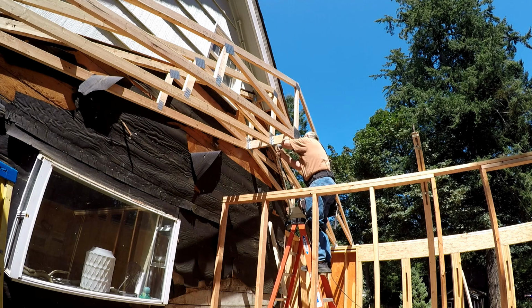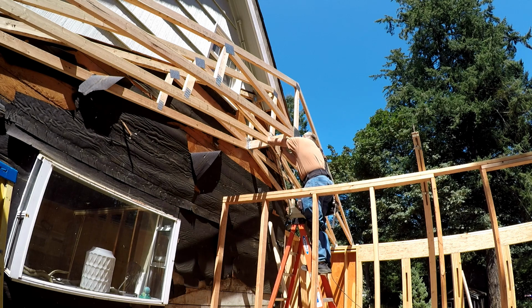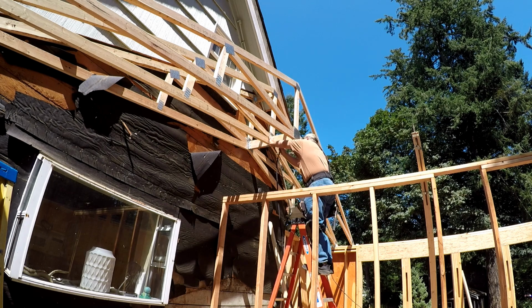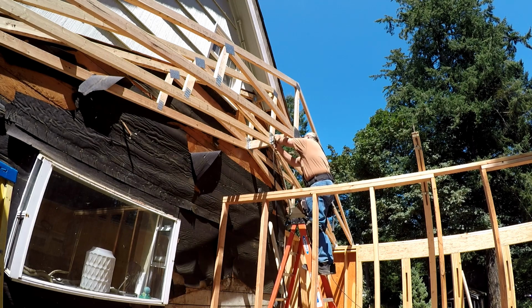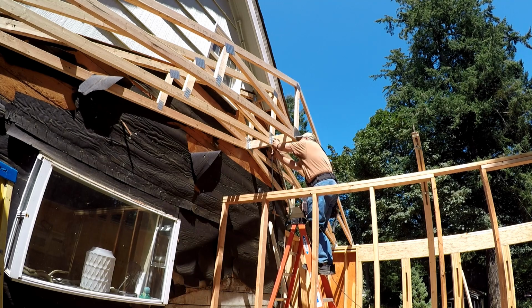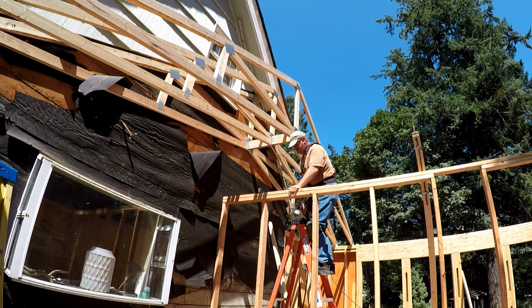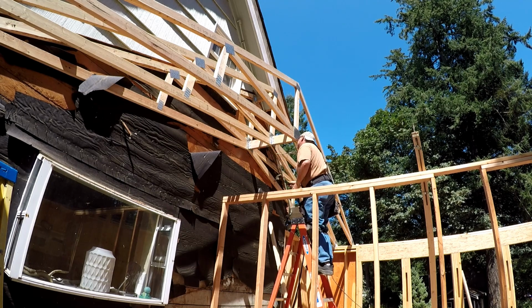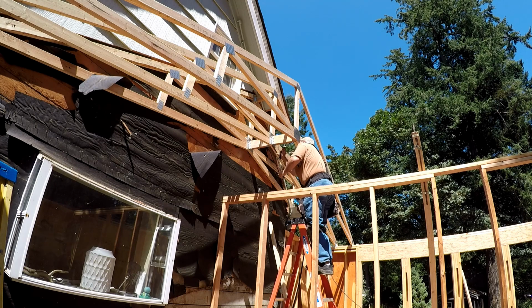So I have the air nailer there, palm nailer, and I'm just going to be popping in a couple of number 10 Simpson galvanized nails, and I'm installing a LUS, I think it's a 6 bracket for a 2x6. Those are 2x6 boards that we are putting to block between trusses. And this is just the first block. The manufacturer's instructions have many more blocks going in place.